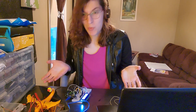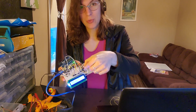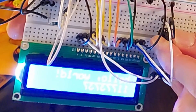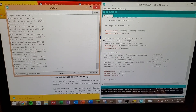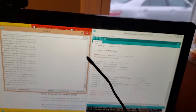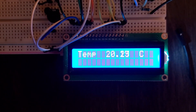I was trying to figure out why the LCD wasn't working and realized I hadn't read the instructions — there was a potentiometer, this little black piece, that actually controls the contrast of the screen. If you stick a knob in and twist it, it controls the contrast of the display until it's perfect. Hello world — I made it say 'poop.' And now we've got temperature readings that make sense: 21 degrees, which is room temperature. This thing is just chilling out in the room at 21 degrees and measuring it accurately — wonderful.